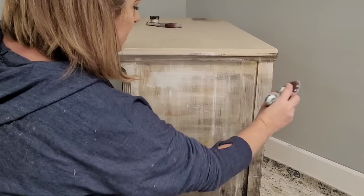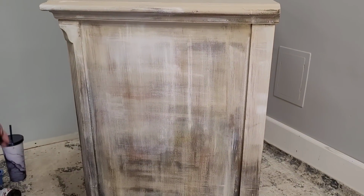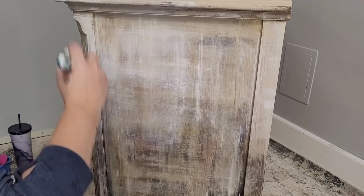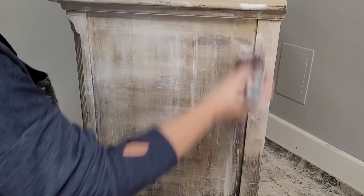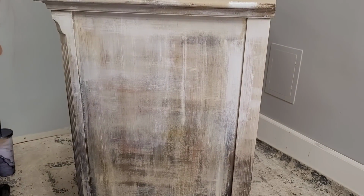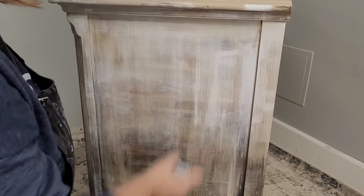So I'm just going to use, again, a super soft hand, but this time I started with a little mist of water. And it basically ends up being a color wash over the top of my paint. So that little bit of water helps my paint go a little bit further than our initial dry coat did. But you can still see those colors peeking through from underneath in that cross-hatching pattern. And I'm going to do this with all 5 of my colors, just like I did on my base coat.